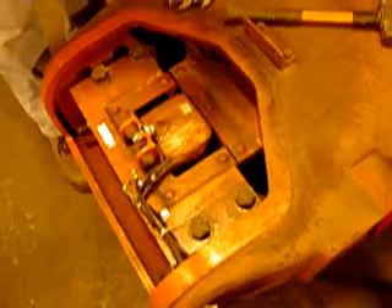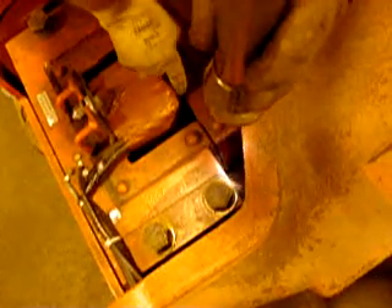Now, you want to check and make sure that the air gap is parallel. The top may be a certain air gap — let's say it is 70 thousandths of an inch — but you also want to make sure that the very bottom of the air gap is 70 thousandths too. Make sure it is parallel. When checking an air gap, it is common practice to only check the two ends and not the middle. It is a machine surface.